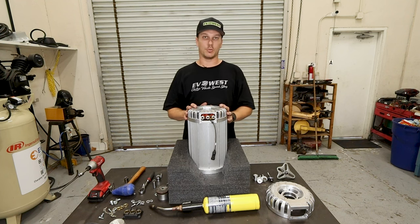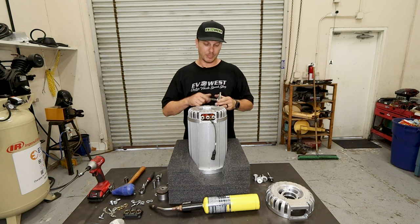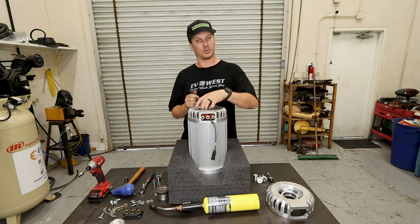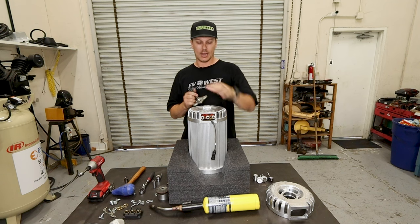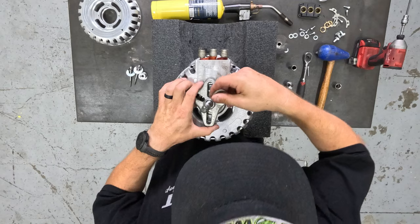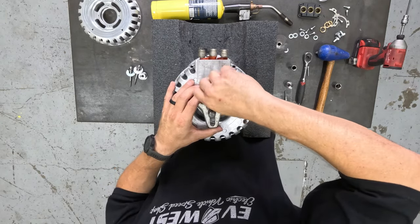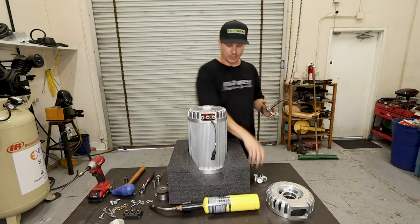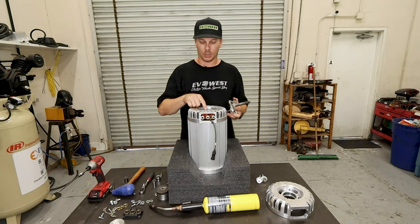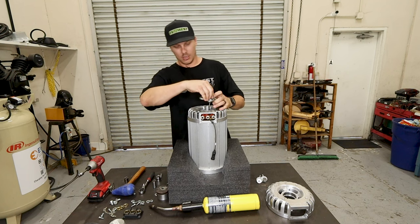When you have all 6 bolts removed, you can then use a small 3-bolt bearing puller to pull the actual center bearing, the support bearing, out, and the whole end bell will come with it. In this stage, you can use a socket or something that goes around the encoder end so you don't damage it when you pull the end bell off.